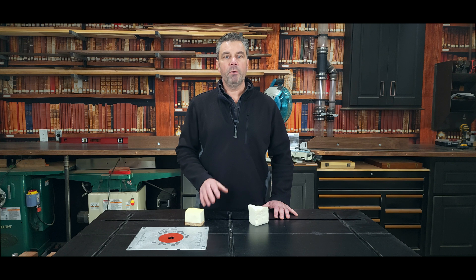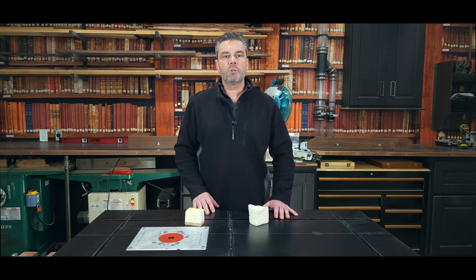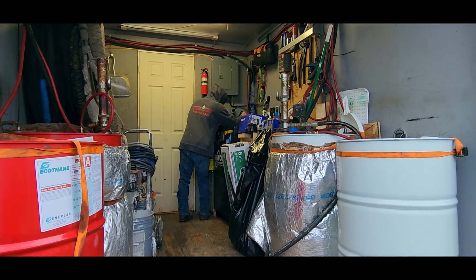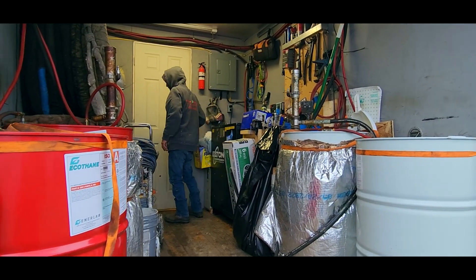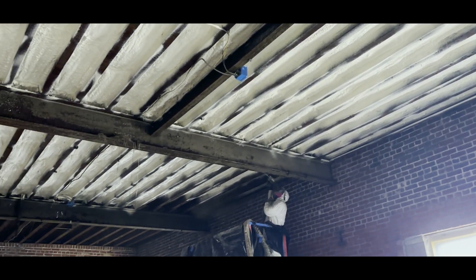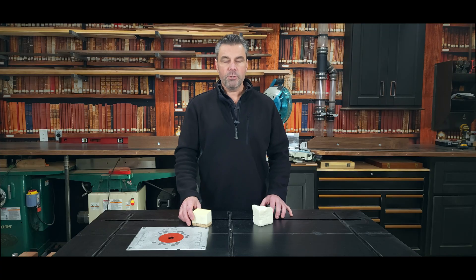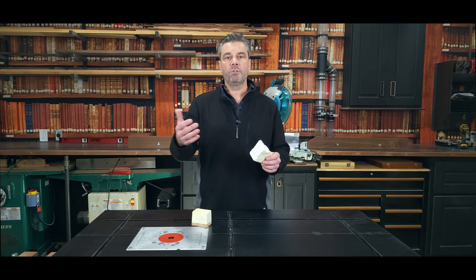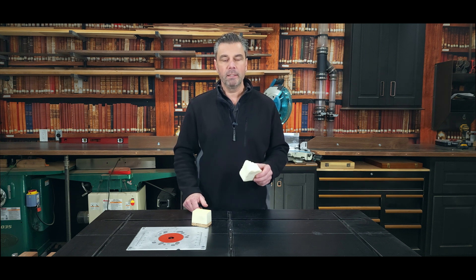Let's talk about the cost difference between both foams. When the contractor comes to your house with his rig and full drum setups, the sets he's buying cost pretty similar between an open cell and a closed cell foam. The difference is really the yield he gets out of the foam when he goes to spray it. When spraying closed cell foam, he may only get 3,500 to 5,000 board feet out of that set, whereas with open cell foam he could get up to 15,000 — maybe even 18 or 20,000 board feet. That's where the true cost difference comes in between both products.